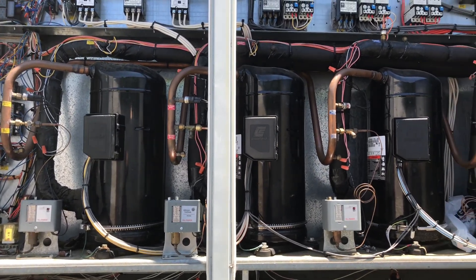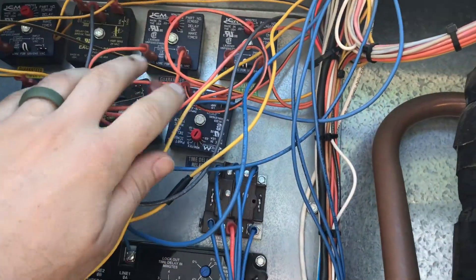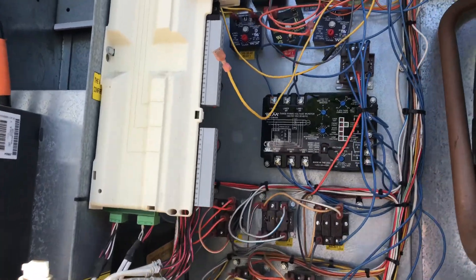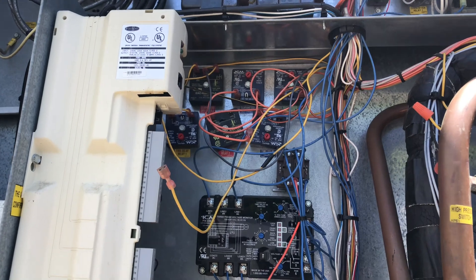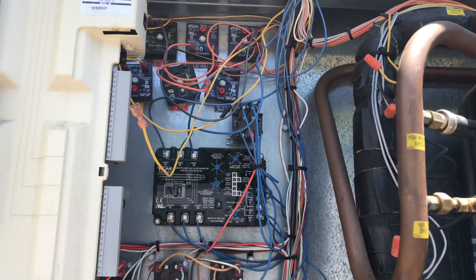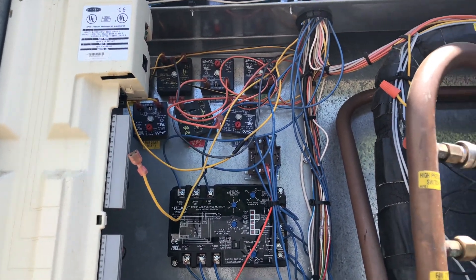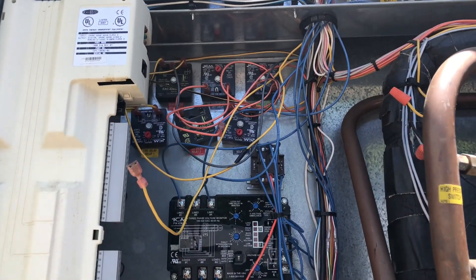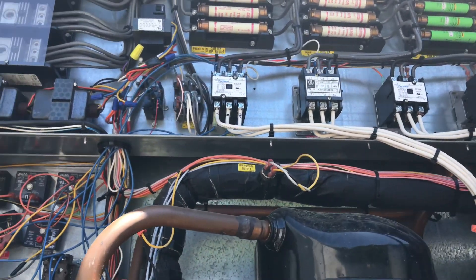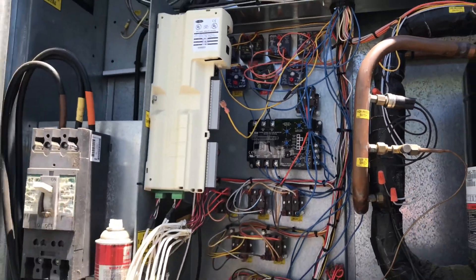I figured I'd go over this for you guys — if you're on a job site with a similar type of machine, it might save you a lot of time. Another thing I'm going to do to prevent this from happening again: you can see on these little ICM delays it says 1.5 amp max. So I'm going to put fuse protection in between the contactor and the delay. I'll put a 1 amp fuse in there — if the contactor coil draws more than 1 amp, it'll blow the fuse and won't wipe out the delays. Once these contactor coils go bad they draw more than that 1.5 amps, and that's why you end up with that melting like we've got there.